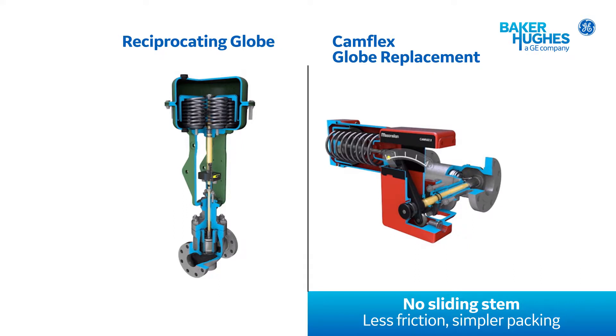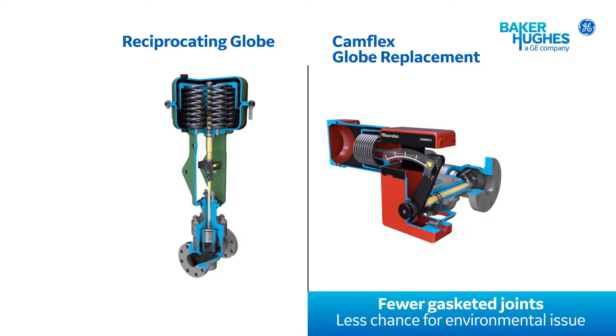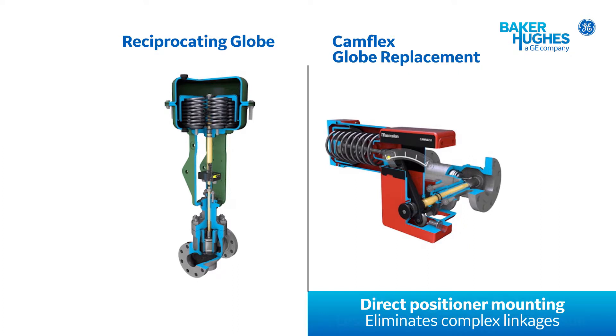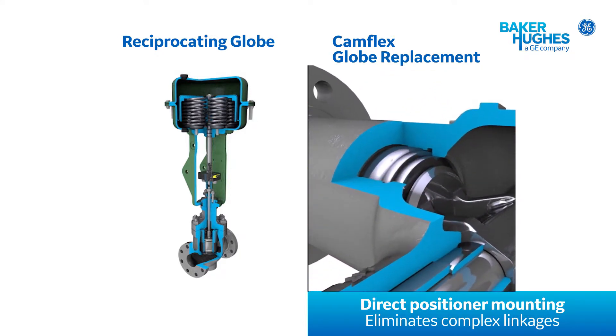The standard EF seal provides low emission tightness. The integral body design eliminates the typical gasketed body or bonnet joint, simplifying maintenance and removing a potential leak point. Direct mounting of positioners provides more accurate positioning control by eliminating intermediate linkage between the valve shaft and avoiding lost motion friction that could otherwise be caused by wear over time.